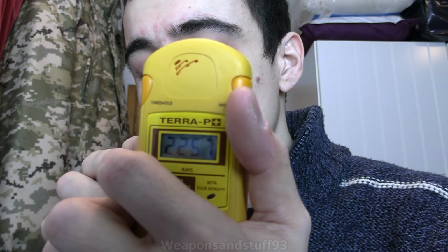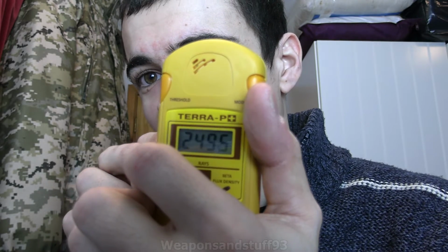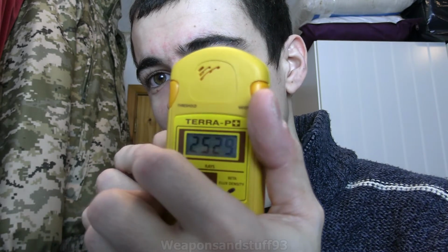The only thing I'd like on this, but they don't do it, is if it actually gave you a counts per second or counts per minute interface. That's the only thing that's lacking, because that's technically what Geiger counters measure, so it'd be nice, because you can hear it's physically counting when it ticks, but you know. So anyway, the point I want to get across is on this, if I put the strontium-90 on it, it only registers when it's above the beta tube like it should, because the housing is good enough that it only allows gamma through.